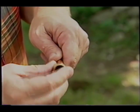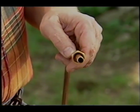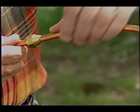We're ready to get to work. You simply put the tube in this part of it. Almost made a mistake — this is where everybody makes the mistake. You have to put this nut on the tube first before you flare the end of it. If you don't do that, it'll never fit.